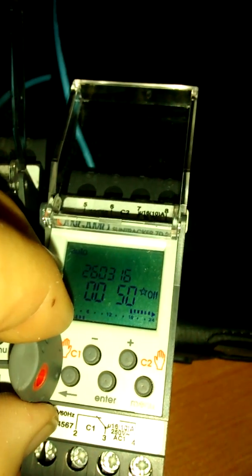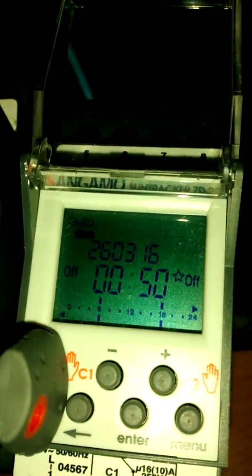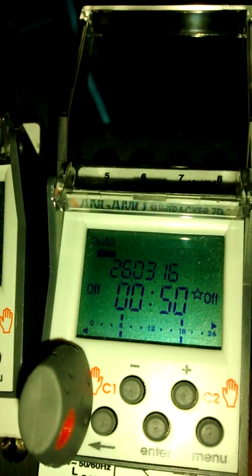Last thing to show is the key. If the key has no program, it's new, it will show that it has no program. Otherwise, when you first put it in, you've got to be careful, it just flashed, which means it just touched the contacts. You have to put it straight down. It's reading the key. That's showing you the key's in there. Now nothing is happening, you have to wait. Right, now it has read the key into memory. It has overwritten what's in the internal memory.